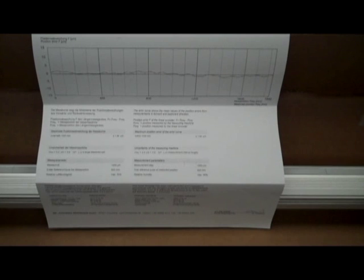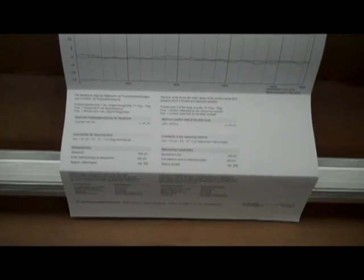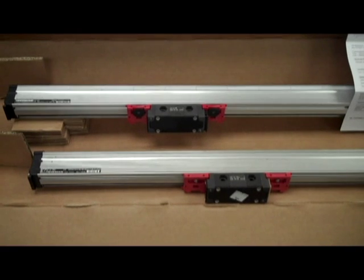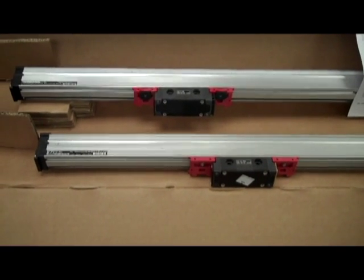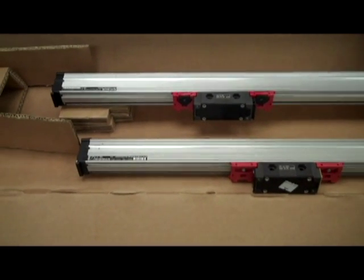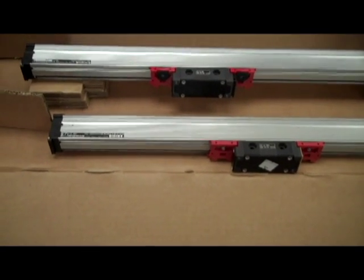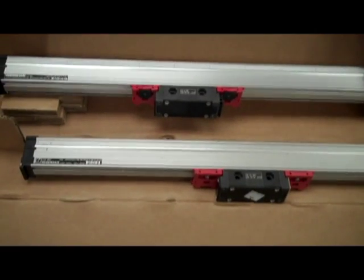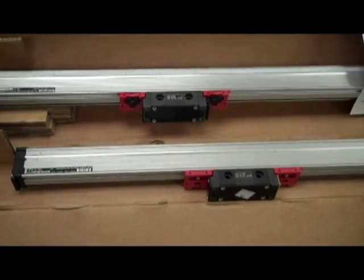You can expect to achieve even higher accuracy if you were to order a 3 micron grade scale. This scale has been replaced by the LS187. The LS186C uses four-field scanning, which is more susceptible to contamination than the single-field scanning currently used by its replacement, the LS187. The LS187 is the same in mounting structure and uses the same hole pattern. The most noticeable external difference is that the LS187 has a metallic read head and metallic end caps, and uses single-field scanning. Here in the catalog, it looks nearly identical to the LS186, with just a few subtle differences.